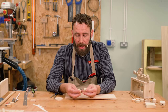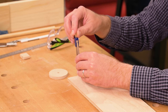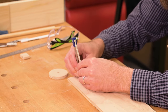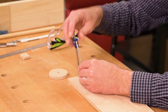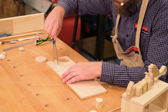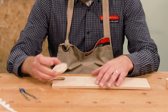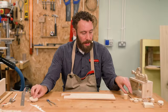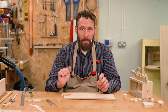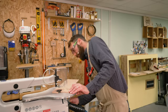We've created our two little cams that are going to sit under a disc, but now we need to make our disc. I'm just going to mark out a circle on a bit of ply — push the compass point in and mark out a circle. Then we can cut this on the scroll saw. We need to drill a little centre hole to receive our dowel — that's a 6mm dowel so we'll use a 6mm drill bit in the drill press.